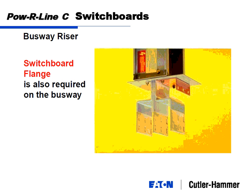Here's what it looks like physically. This part is the part that runs instead of the cable. So you cross for a distance, and this part here sticks into the switchboard and separates A, B, and C. So A, B, and C are right next to each other and then spread out. And just FYI, guys, busways are a wiring system, they're not panels. Just like you can use conduits instead of wires, you can use busways to take 2,000 amps from a 4,000 amp switch gear 500 feet to feed a 2,000 amp switchboard. It's a wiring method. That's exactly what it is.